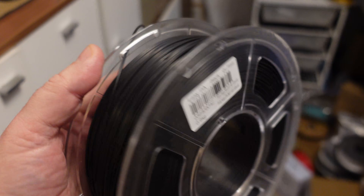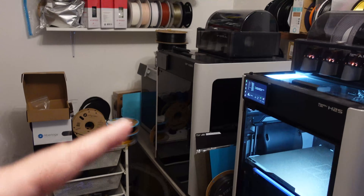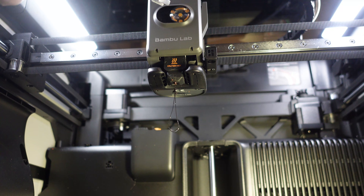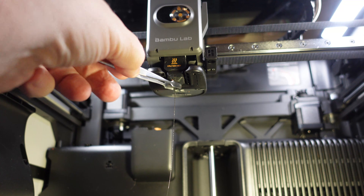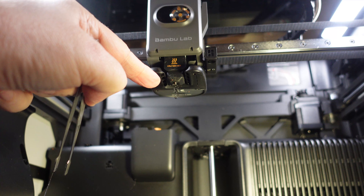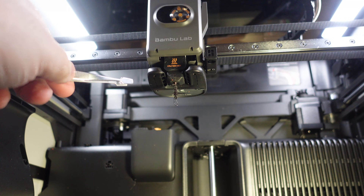Let's dry something. Easy PA Nylon from Sunlou — I forgot about it, so it was sitting in that corner on open air for almost two months. One quick method to check if filament is wet is to extrude it, cut the extruded line, and observe the oozing — if it's big, it needs drying. You can also just listen for the popping sound.